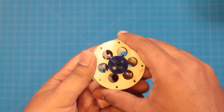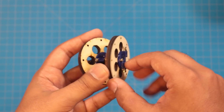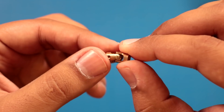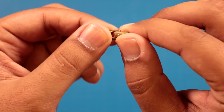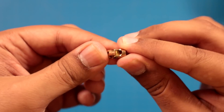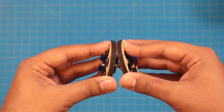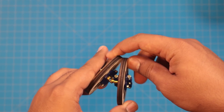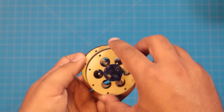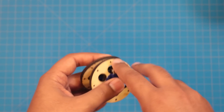The discs form the heart of the structure, and these are coupled together with some 3D printed adapter plates. These adapter plates are specifically designed to mate to teeny tiny universal joints. It's not necessary to use universal joints for a build like this, but I have them and they're super cool. Most importantly, I need to allow rotation along two axes but not twisting — no twisting action. Because if I want to bring these two discs together by contracting a thread, I want the holes to align and stay aligned. If I could twist these discs independently, the holes would be misaligned and we wouldn't get the force along that axis that we want.